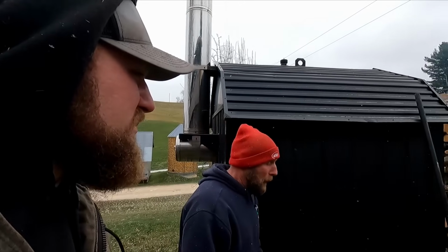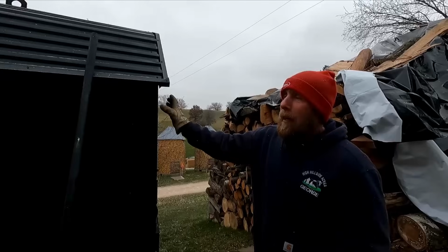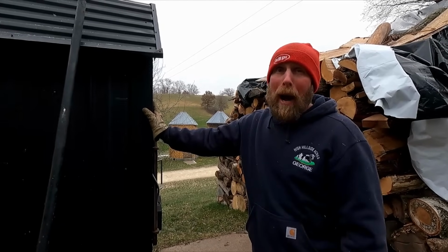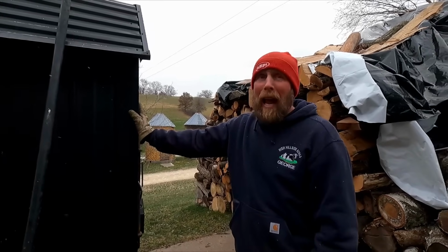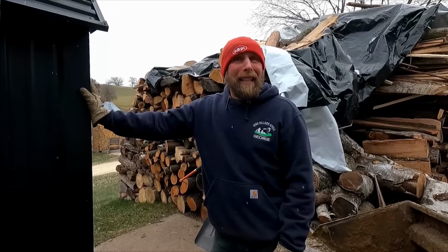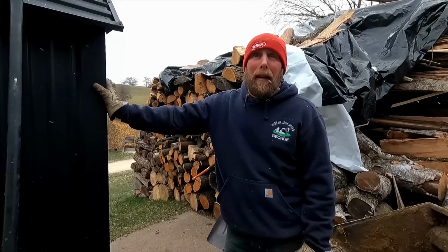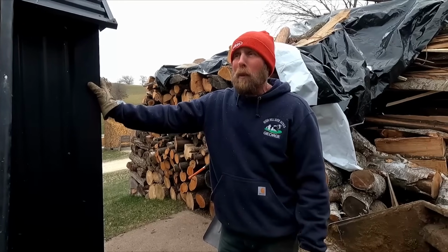And nothing lasts forever, but you'll ask people, okay, so how long do these boilers last? And nobody has a definite answer. It's how they're treated. One guy said, don't burn garbage in there. I'll burn cardboard boxes and stuff like that, especially to get stuff lit, or maybe paper sacks. You know, once in a while you got some wrapper from something, but never stuff with plastic in it. It's just simple stuff like that. Because over time there's a lot of acids in that eventually coats your walls in here and causes acidity to rust her out faster.